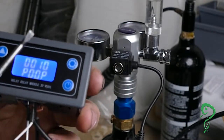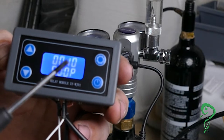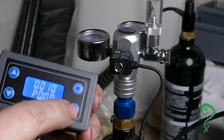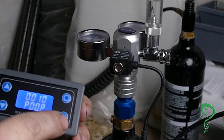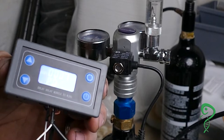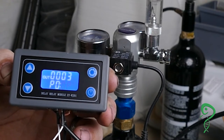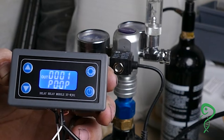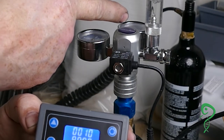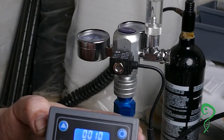Now I still have it set up for 10 seconds — I've unplugged it numerous times. The cool thing is it saves the time, which is good. So if I watch the bubbles right there... and it shuts off. You can see the line pressure is slowly going down, that's why the bubbles are slowing down. It's actually shut off the solenoid.